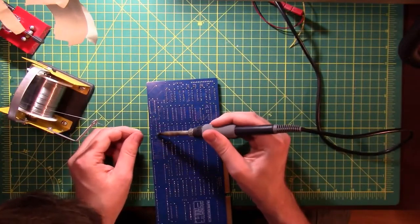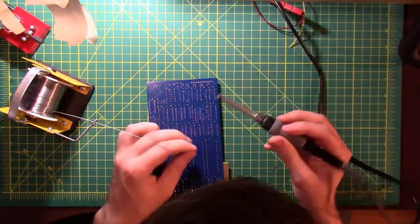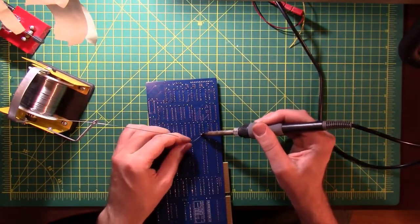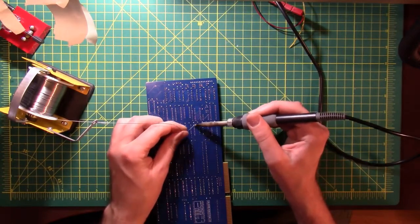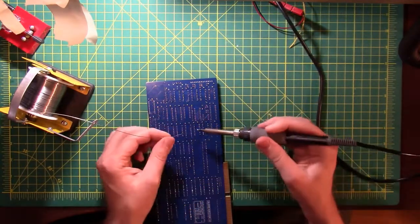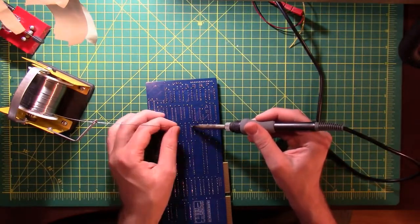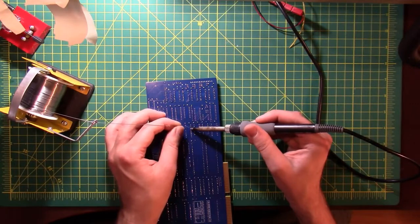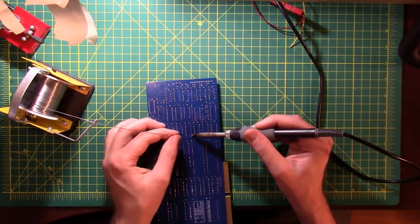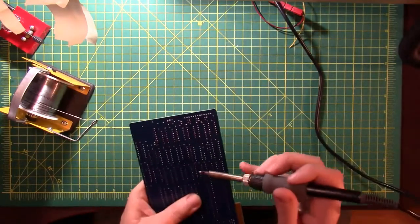There's something about this one pin here on this socket that I did before. Every time I look at it, it just looks like it hasn't been soldered. This is actually a pretty forgiving thing to do. If you make a mistake, it's easy enough to desolder it. Or as you've seen with putting these sockets in, if they're not in quite straight or aligned the way you like, all you need to do is reflow the solder and fix it. And I just remember building things out of wood when I was younger, and you really can't add wood back after you've cut too much off. I mean, you can, but it depends on the process. So if you're framing out a stud wall and you cut a 2x4 an inch too short, you're really pretty much better off starting over with a new stud.